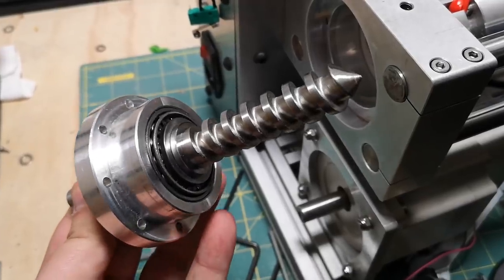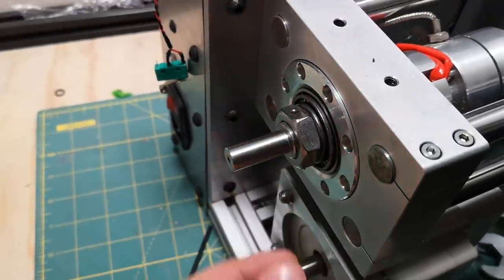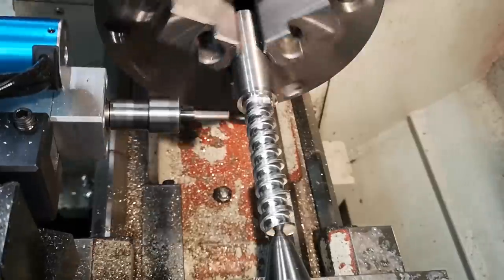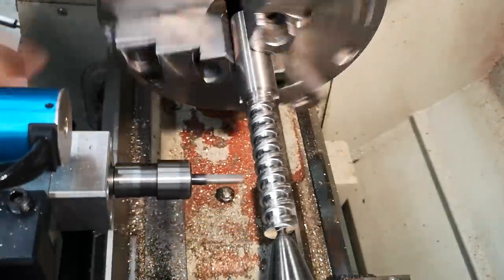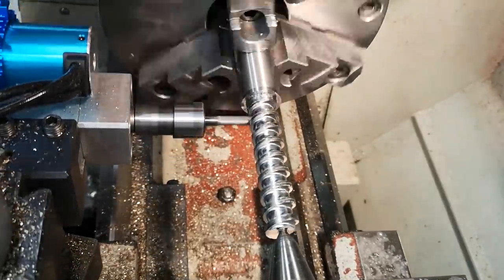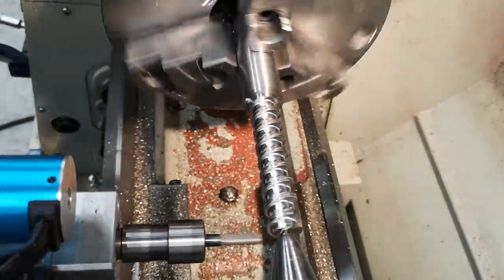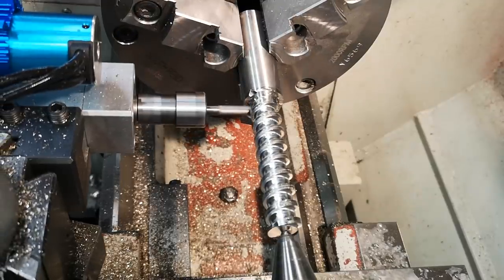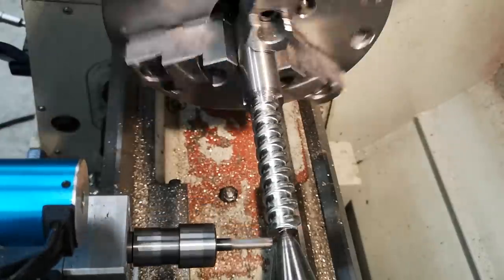So now the screw is finished. I've been getting lots of interest about this machine, which is great, but I suspect a lot of people are going to have difficulty cutting the screw as well. I'm going to fire this thing up and do a video, I promise, but then I might spend a little time afterwards designing a piston cylinder headstock for it. Piston cylinders are not often used in industry because the heating isn't very uniform — it'll heat from the outside but the core of the plastic will stay cold. But for such a small volume, I think it'll be okay, and it'll definitely be a lot easier to make.